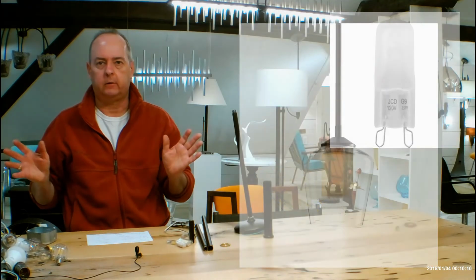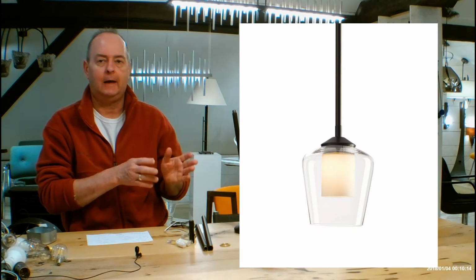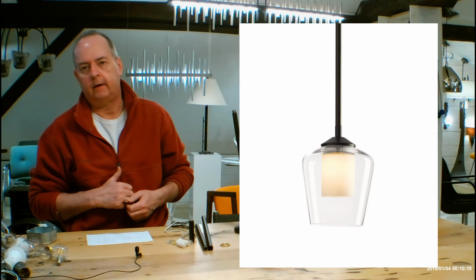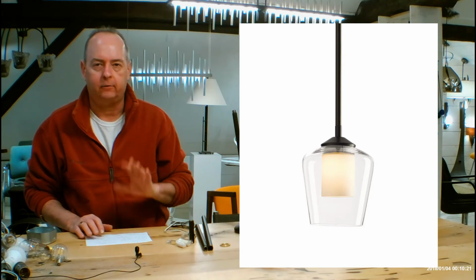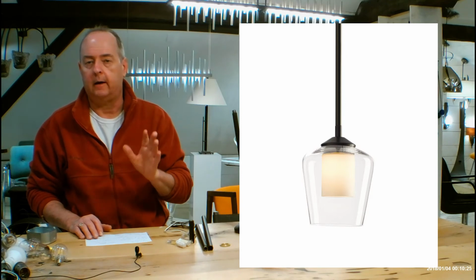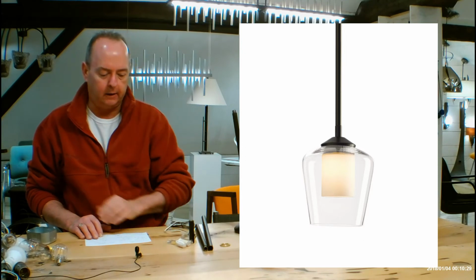Anyway, I talk about the color of light with LEDs all the time. You'll see a spectrum of light called Kelvin. 2700 Kelvin or 2700 K is going to be super yellow like the setting sun. Way on the other side of that is called daylight, and daylight sounds warm, but it's not. That is a very cold blue light like a hospital waiting room. That's going to be 4,000, 5,000, 6,000 K or Kelvin.